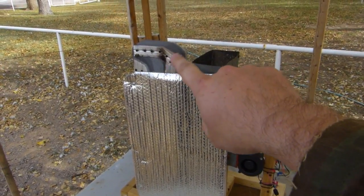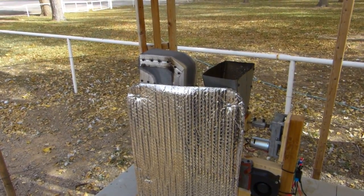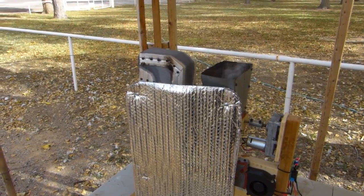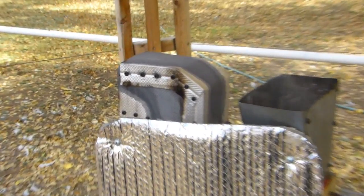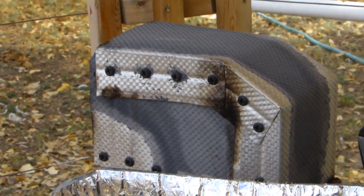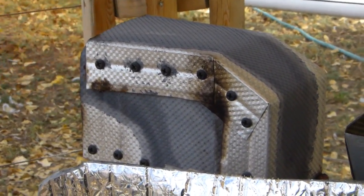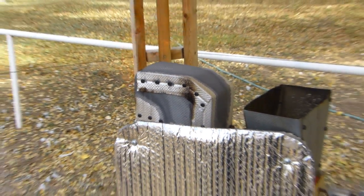We'll just keep doing this until it runs out of the four pounds of pellets. This whole stove is just made out of 25 gauge sheet metal studs — like steel building studs, the regular Dietrich brand. I really didn't put much of a gasket in there; I just put a good one inch overlap and a whole bunch of really good quality sheet metal stud screws.